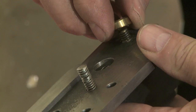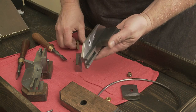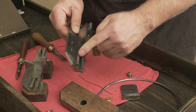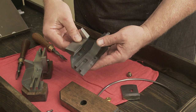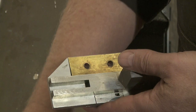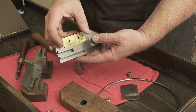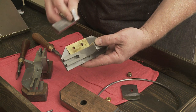They're fastened to the bottom plate by a large nut. Now that I have the body carriage unit fastened to the bottom plate, I'm going to position the mouthpiece on there, but first I have to put this shim in position. I also use this device which is going to adjust the height of the type.